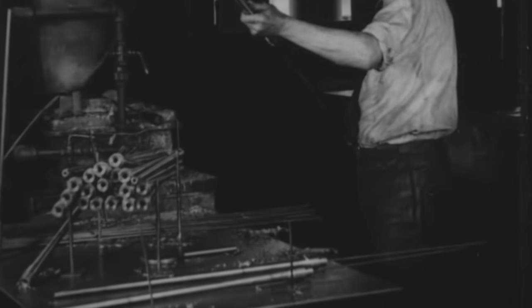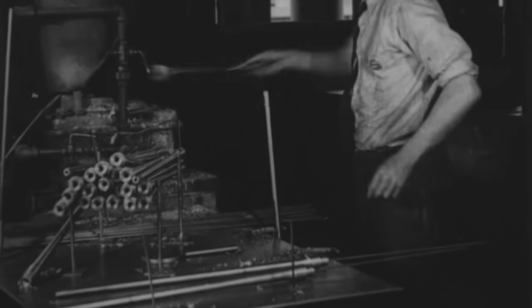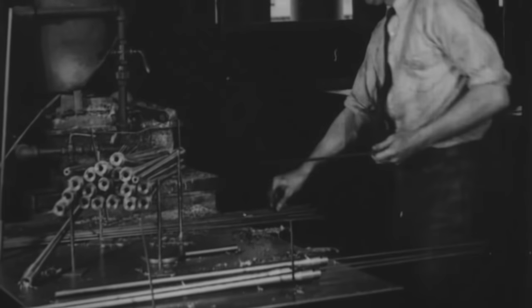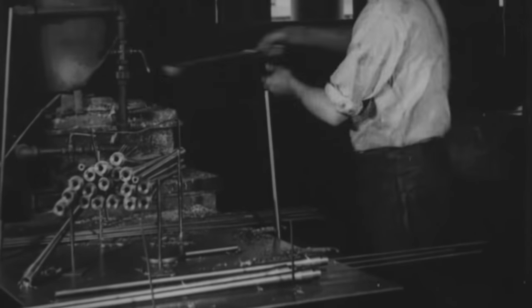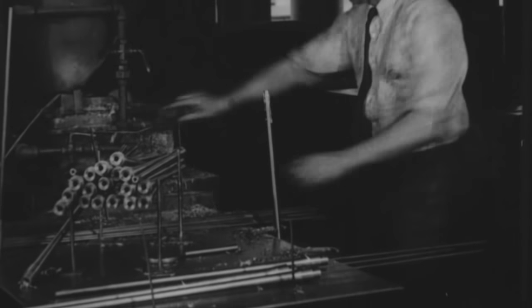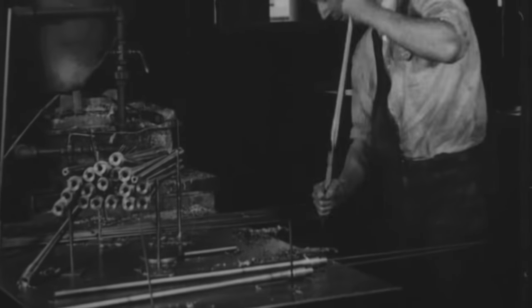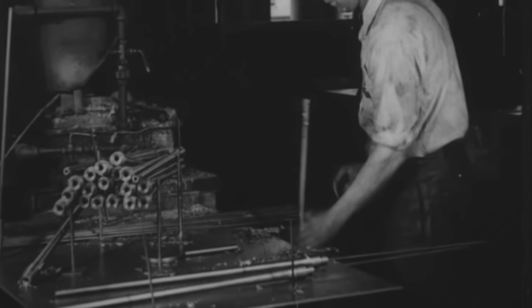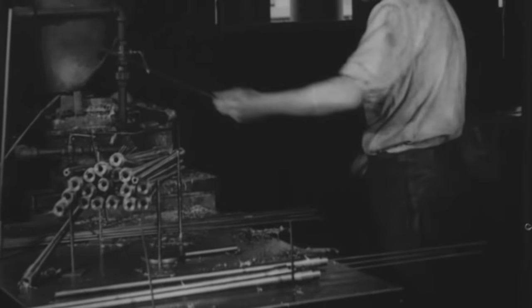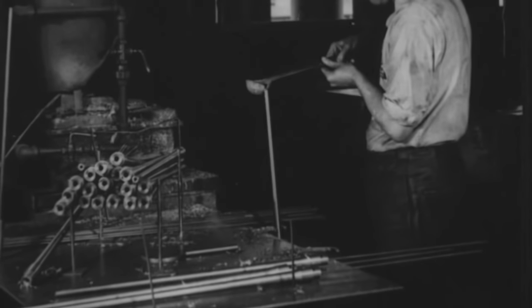Okay, wait, what's lead lapping? Right, lead lapping is a way of polishing the barrel. Oh, God, that guy died so soon. Yeah, just dunk that lead in there. So what he does is he puts a rod partway up, which will have a sort of stopper on the end and a jag to hold the lead. He pours some lead down, and he makes a lead stopper that is intimately shaped to the inside contour of the barrel. You then put some abrasive compound on it and push it back and forth a lot, and it polishes the barrel. But it's interesting that they actually hand lap them or machine lap them, possibly. That's brilliant. I've got an Ithaca 37 shotgun that just keeps sticking on extraction, so I know what I'm doing now.